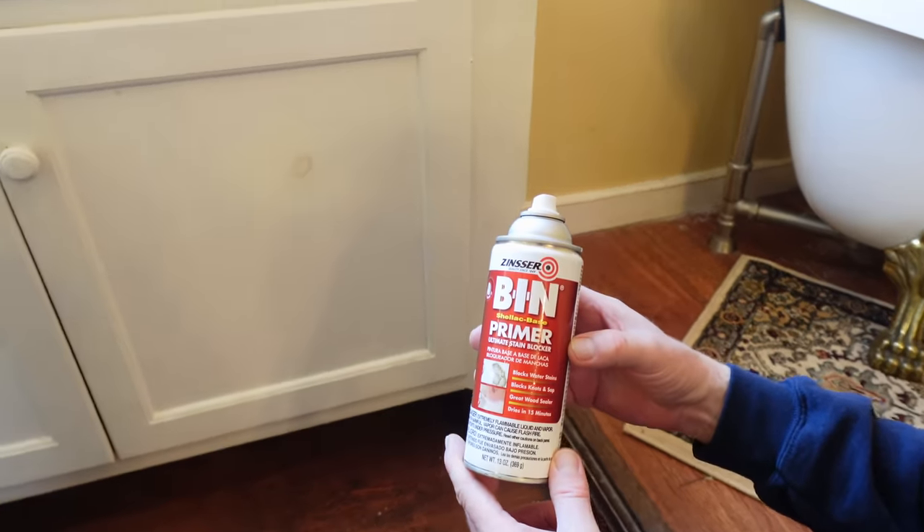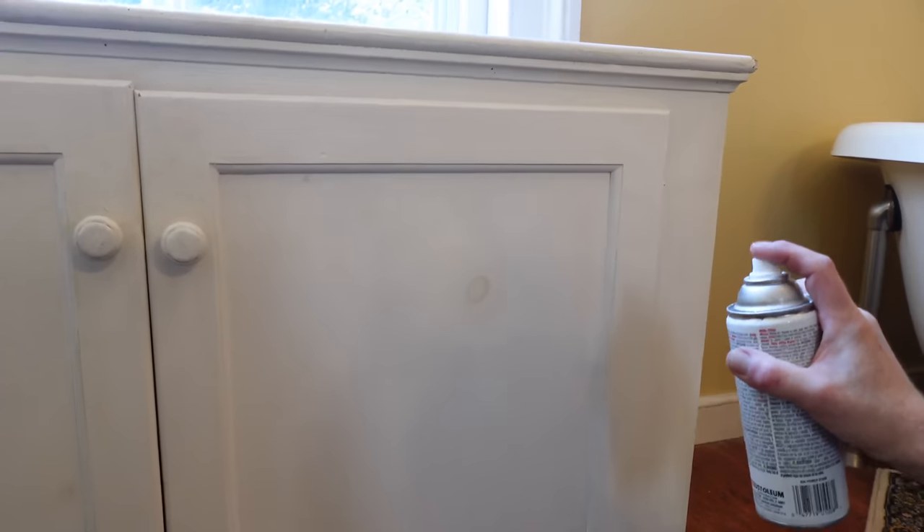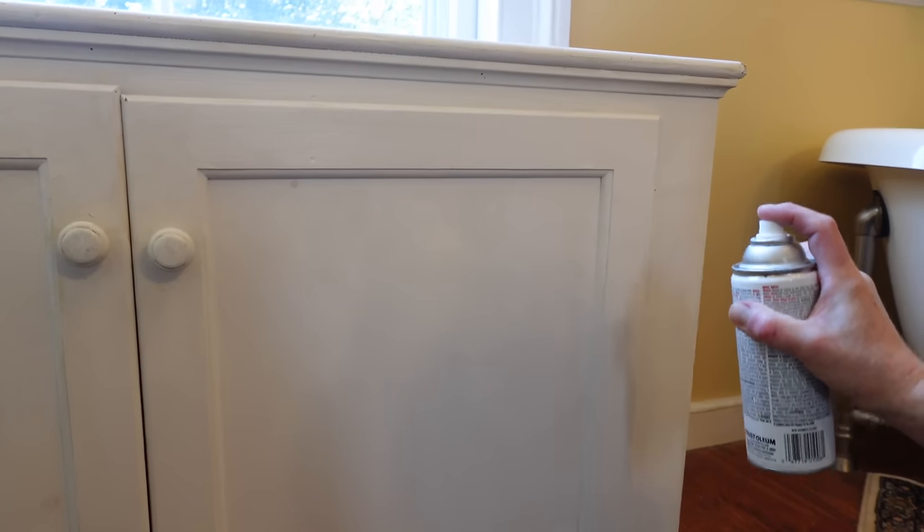My windowsill is only about six inches wide; the cabinet is 12 inches, so it gives me a large broad space for plants. This cabinet is made of pine, and when I painted it, the little knots in the pine showed through the paint. Let me show you a quick cure for knots in pine: I found this spray-on primer at my local hardware store. The primer contains shellac, which permanently seals the resin in pine knots so the wood can be painted. Of course this entire cabinet could stand to be repainted, but we're not doing that today.